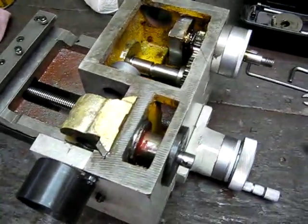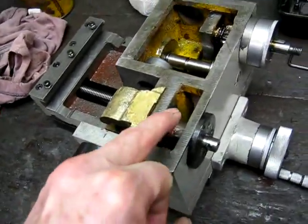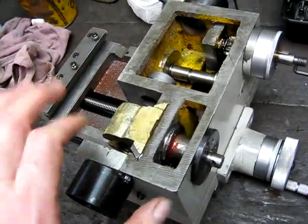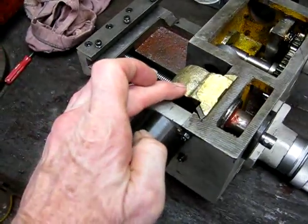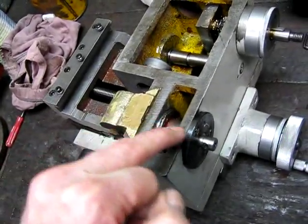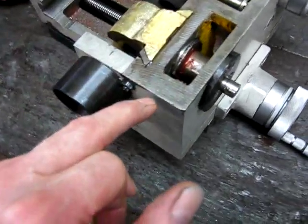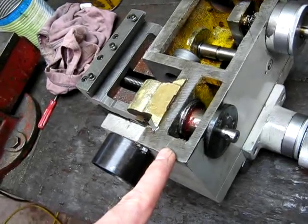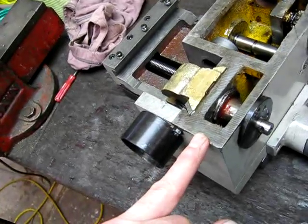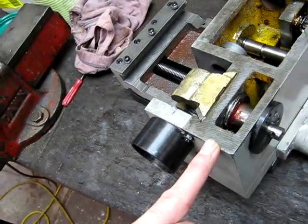While I had it apart it was making a funny noise. I found that the two pins on the cam that open and close the half nuts were worn, because once again there was no lubrication in there whatsoever — they just put it together at the factory with no lube. Ten years down the track, one of the pins is a mill undersize and it wasn't totally releasing from the lead screw, so it was just touching and making a noise as I traversed the carriage.